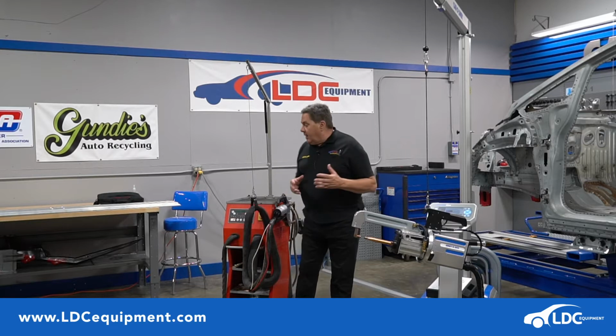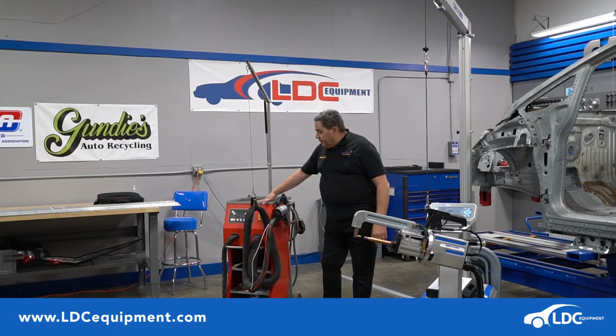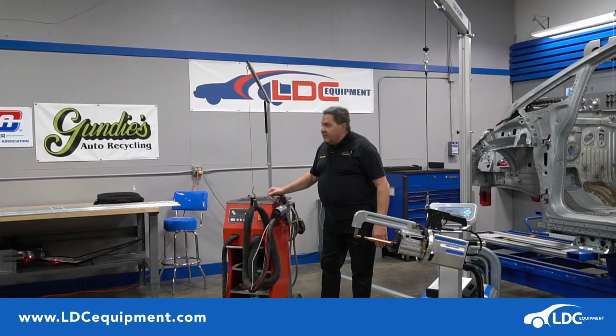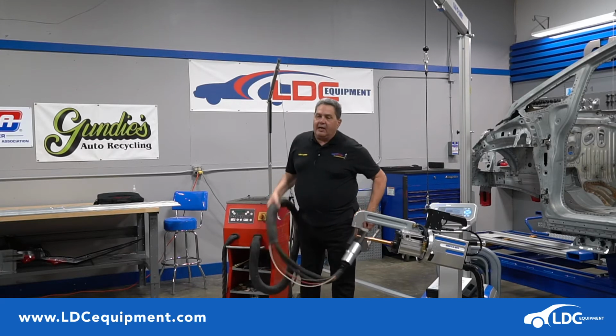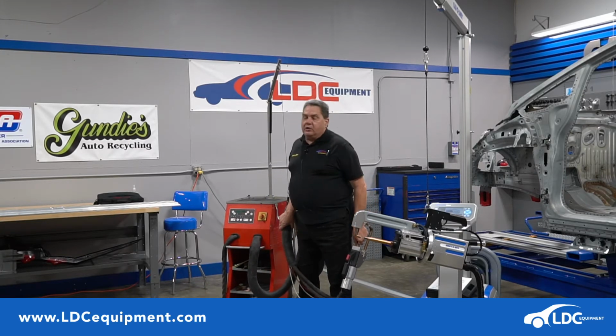Today I have here an early inverter welder, and we want to show you the changes in the new technology of welders. This is an early inverter welder. It was 8,000 amps maximum capacity, 600 pounds of squeeze force, and had a gun like this. We called these cable welders because they had heavy cables, and this was probably built 20 years ago.